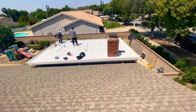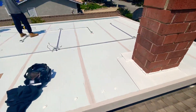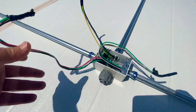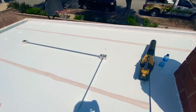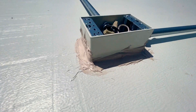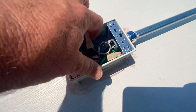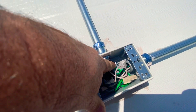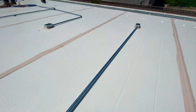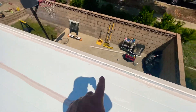This is what the conduit looks like on top. Before I jump down and show you guys the patio, I just want to show you some of the conduit that is on top of it. The fellows are getting ready to wire everything. We have junction boxes. This junction box here — everything's been sealed inside of there. We have sealant around this, and I've also got sealant underneath the box. You're going to see a screw right here, and there's sealant underneath those screws as well. We've got the metal EMT up here, all of the boxes are properly sealed. Everything is sealed — all the screws.